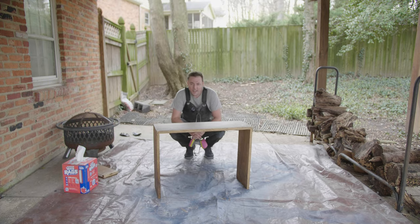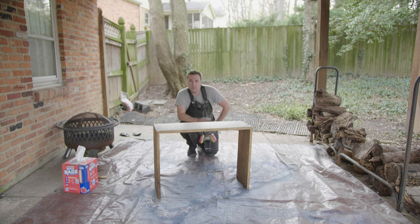All right, there it is. I think overall I like how it looks. It does a better job of letting the natural wood grain show through than the Varathane wood stain. As far as ease of application, it's a little tricky to get an even coat — you have to not overwhelm it in one spot. I do like how it looks, especially on the end grain of the splines; that was really satisfying to stain over. I did notice a couple of spots where there was a little bit of wood glue or filler I'd missed and hadn't sanded down enough. I only went down to 120 grit, so going down to 220 grit in the future will probably help. We'll let this dry, wipe off any excess oil, and then go take a look at it in the space.